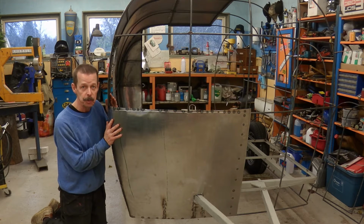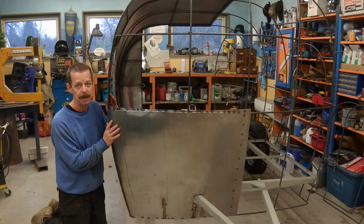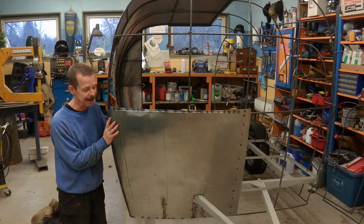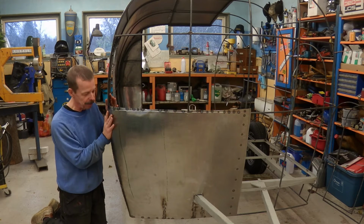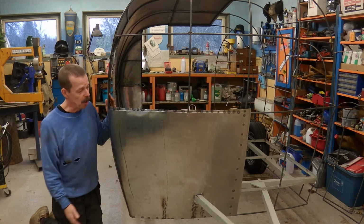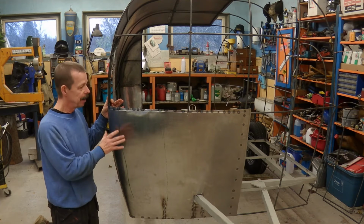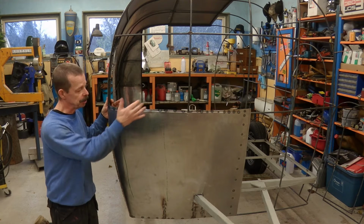if you want to have tutorials about doing things like this and some of the problems that actually pop up, pun intended, once again Peter Tomasini, he can explain it all. But once I started turning this part, this edge coming around, all kinds of stuff started to happen to a panel which before that was looking pretty good. So I had to do a lot of wheeling, turning again, more wheeling, turning again. And of course, hopefully I've learned something, but it's going to be a challenge to do the other side as